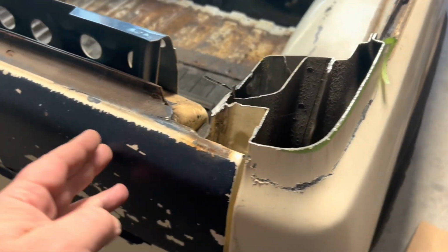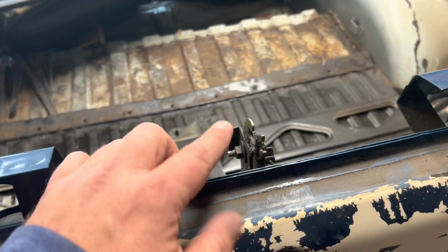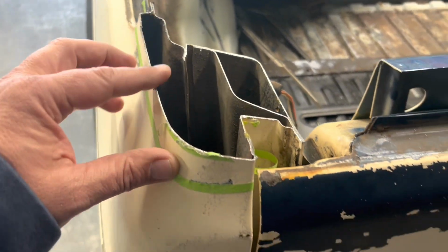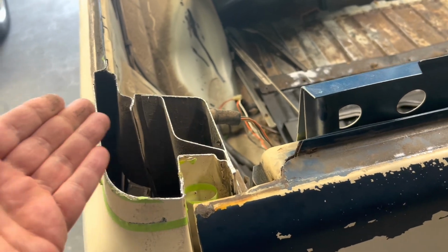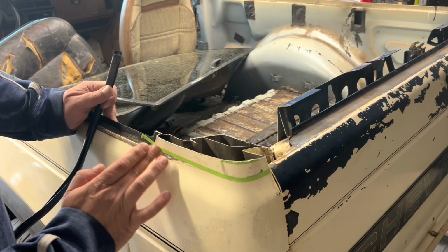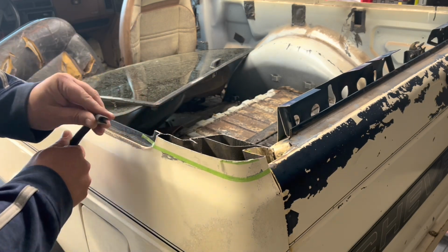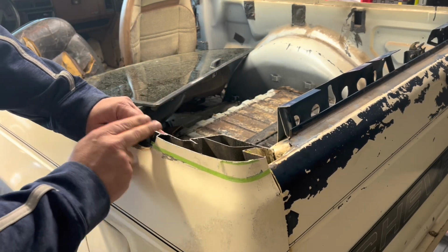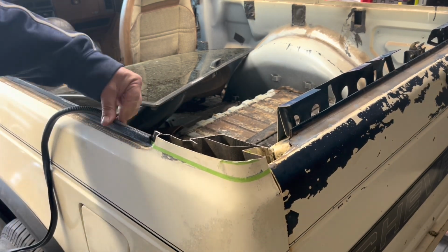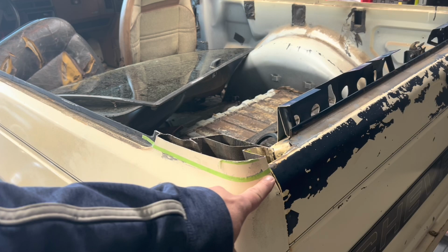Well, obviously stuff like this isn't going to work, right? These sections here on the tailgate, this thing sticking all up. Now, this is not a $100,000 Dave Kindig special, but I do want it to have somewhat of a finished look. I'm thinking if we can get this cut where it's nice and flush, and then weld a cap on. Where I have this pinch weld, we can use this wind lace stuff to give it a little bit of a finished look. See there? Look, it looks finished already. It's practically done.